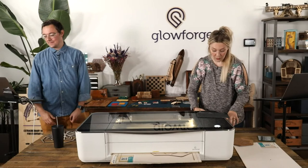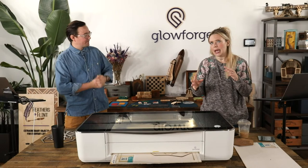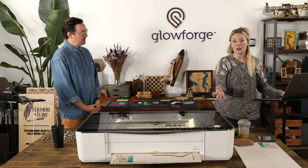Good point. I've seen, rock will depend, of course, on the kind of rock. Sandstone, I know, is engravable because it's real soft. It engraves really well. And on that one, by applying different types of speed and power, you can actually get different colors as a result. So there's all sorts of cool stuff you can do with different kinds of rocks. The community forum is a great place. Anything that's not proof grade, which is our materials that the Glowforge can read with the camera and says, great, we know that material.